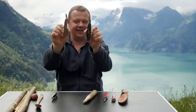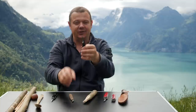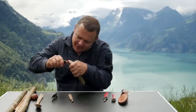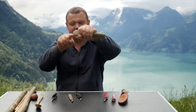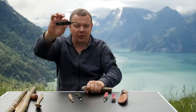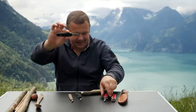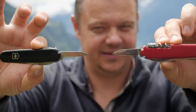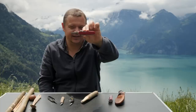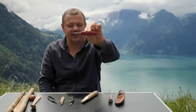Specific carving knives like this or this have a tapered point. With this tapered point you're able to cut very precisely and to cut a very narrow radius. If you often carve such small things, you can also modify your small blade like this. For making this blade, I took away this part with the grinding machine and then I used my Lansky grinding set for making a new edge.